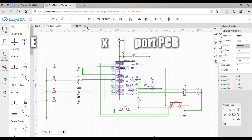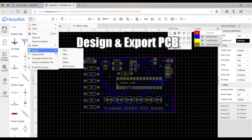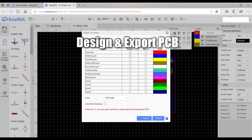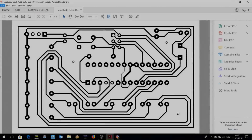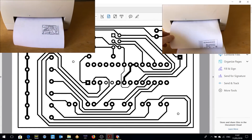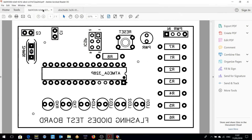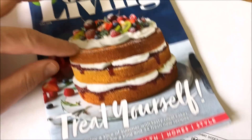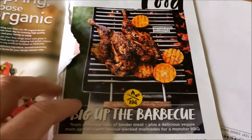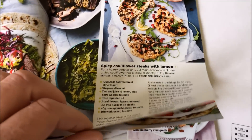Thank you for joining us. Onto the copper board, I use magazine paper — just a local supermarket magazine. The pages are glossy, and the only thing that will transfer onto the copper board from when you print on this is the actual toner. So it's ideal.